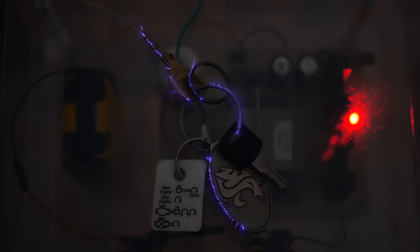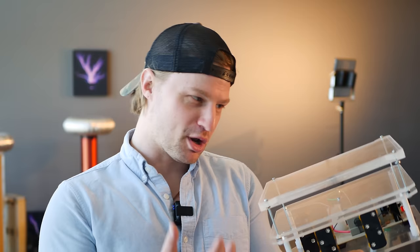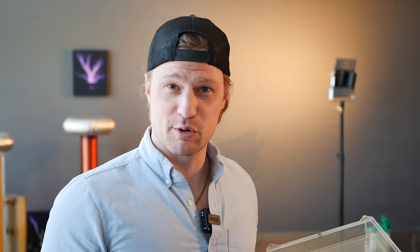Unfortunately I'm not able to test the effect on viruses here in my studio, but these results match up with decades' worth of studies showing that coronal radiation and ozone treatment eradicates both bacteria and viruses. Other objects such as keys can be sterilized by this method as well — just a few seconds of corona and it's good to go. Devices like this can also be used to sterilize really large areas. If left on for a prolonged period and enough ozone builds up in the air, it can sterilize an entire room. The half-life of ozone is really short — about 40 minutes at room temperature — so you can come back two to three hours later and be perfectly fine.